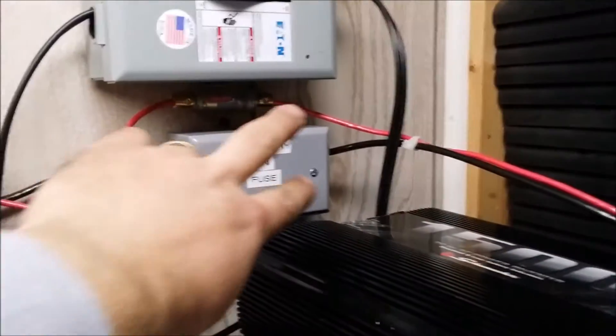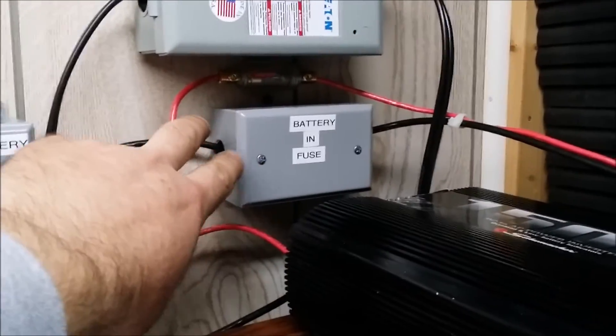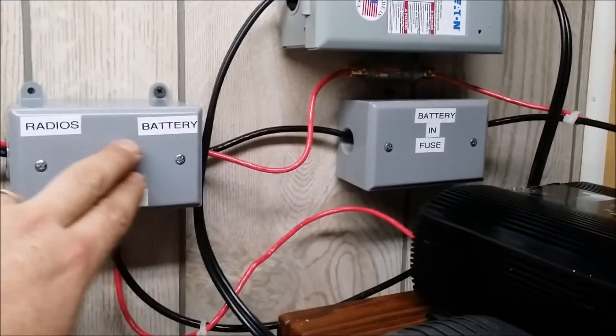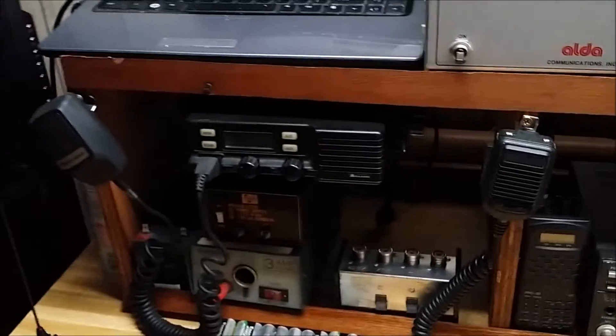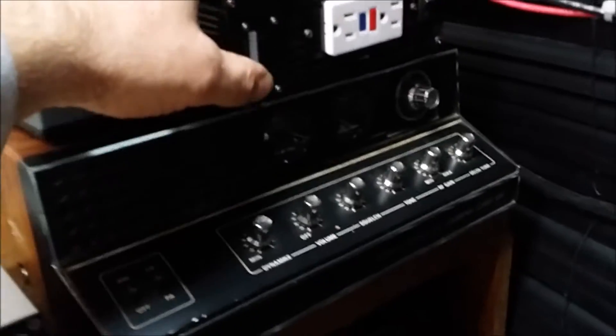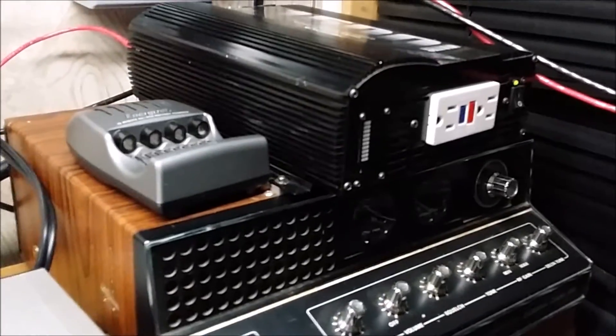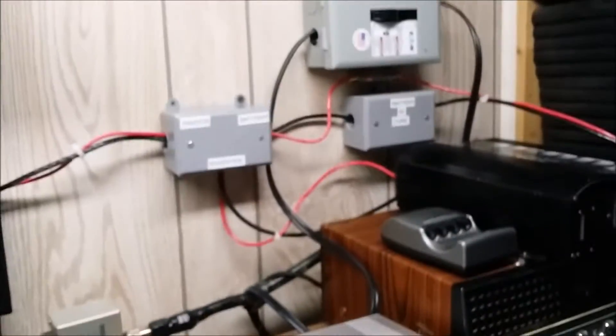The wires come in down the side here into a fuse box with a 40-amp fuse. They come from the batteries through the fuse and into this combiner box. From there, the batteries can either run over to the radios — all my amateur radio equipment can run on battery power backup if needed — or it can go down to this inverter. So if we turn that on, we can run the inverter as well. That's how the simple solar setup is run here at home.